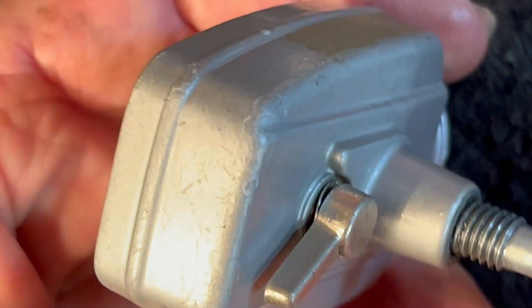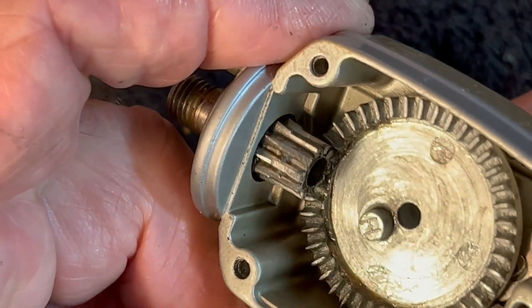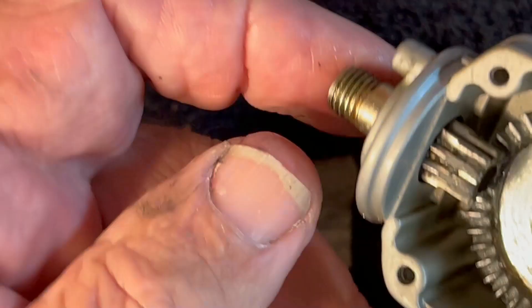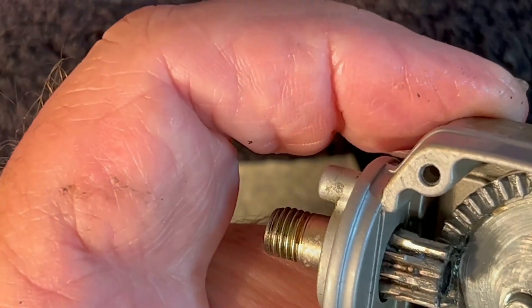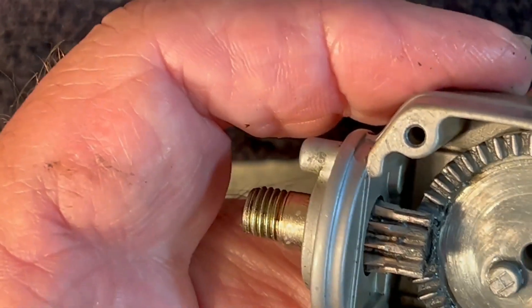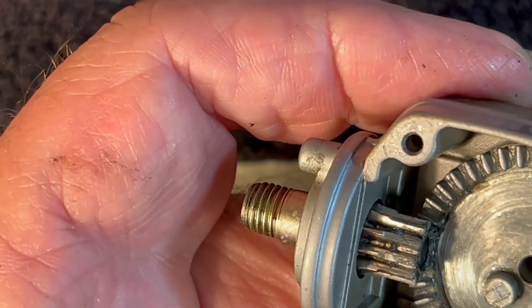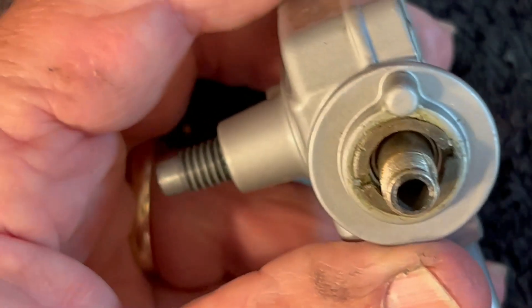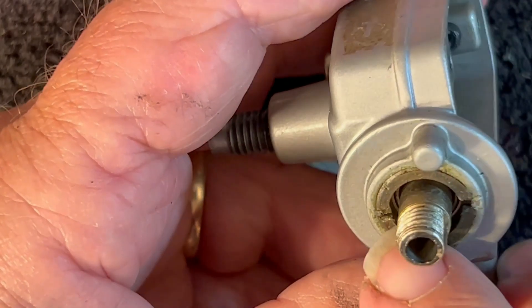There is probably what's causing our gear grinding — this wobble on this gear in this side housing. I'm not sure what we've got in there, but I think this one may end up being scrap, even though the pinion is not bad like I thought it was. It's not bad, but I think the bushing behind this main gear is bad. Depending on what we've got back there, we'll have to wait and see. But in the meantime, I've got to try to figure out a way to get this unscrewed out of here.